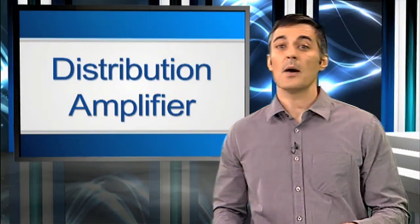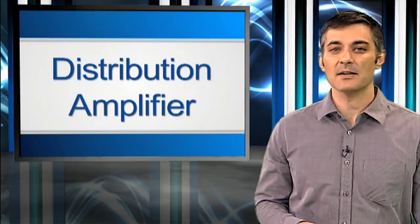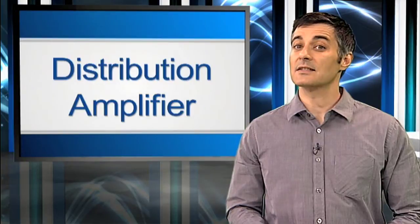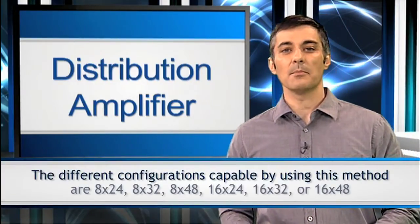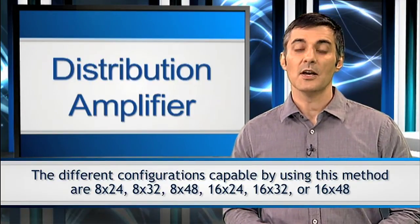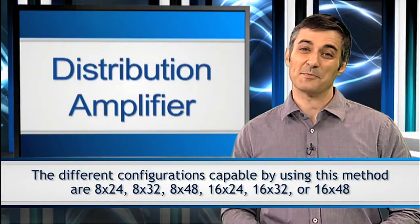It allows you to divide up your sources and split them between 2 or 3 peak series component units. For example, if you had all your sources running through the distribution amplifier and into two 16x16 matrix routers, that would give you a system capable of routing 16 inputs into 32 displays. Now, if we use the same example, but run your sources into three 16x16 matrix routers, you would have a system capable of routing 16 inputs into 48 displays.